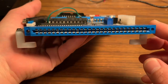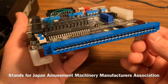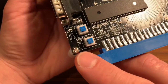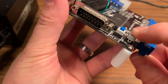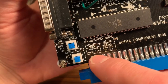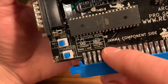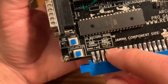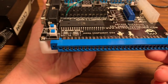We have a standard JAMA connector here that you can either plug your PCB directly into, or use an extender harness. The J1 option has a click button — button out is standard JAMA and MVS Neo Geo; button in is six-button JAMA, such as the Blue Elf, the Pandora's Box, etc. With standard JAMA arcade PCBs, the normal JAMA standard is only three action buttons — buttons one, two, and three.